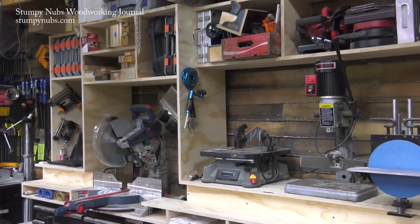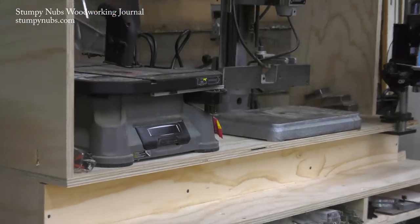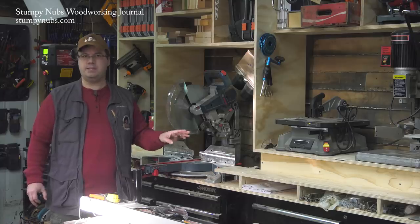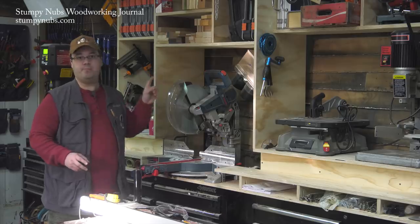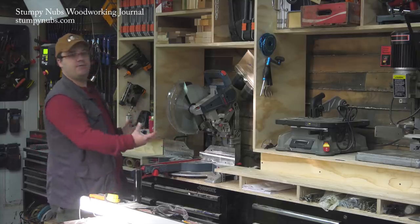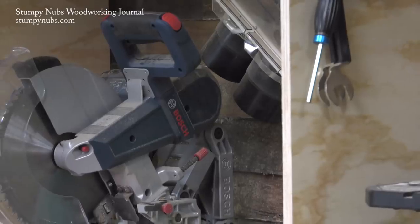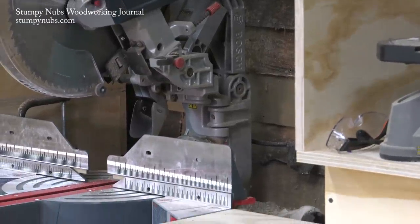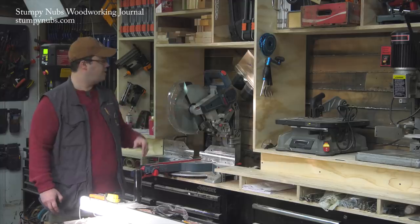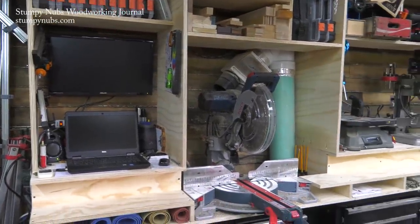The hutch I built over my saw may not be right for you. It does enclose the space around some of my benchtop tools, and if I'm working with really big workpieces, these side panels could get in the way — in that case I might have to move the tool to another bench. But they do serve a couple of purposes. First, it makes the whole workstation, including the storage up above, independent from the walls. I didn't have to worry about finding studs to screw brackets to, and if I wanted to move this workstation, everything just moves at the same time. I also like that it encloses my miter saw — this is the beginnings of our dust collection. Having these walls on either side and the platform up above helps to enclose the dust that flies everywhere, so now I only have to worry about the front and collecting it from the inside. I also like that these walls partially enclose my little desktop area, which keeps some of the junk from accumulating around it like it used to.